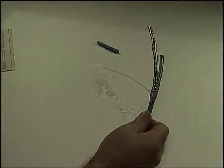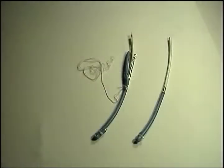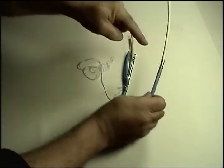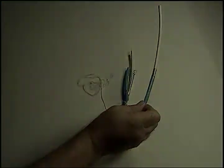All done — that's step one. Here's the before and after preview of step two, where we cut off the outer jacket, binder thread, and most of the shield, leaving a half inch of shield with the drain wire wrapped around it.